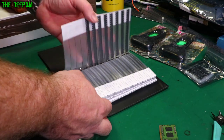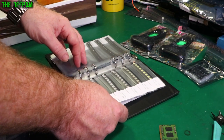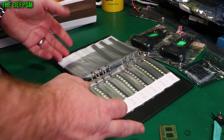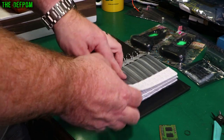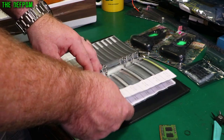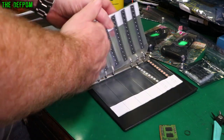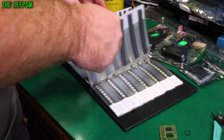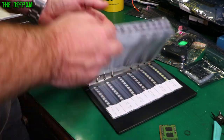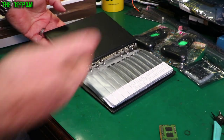It's a sample book - of LEDs! You can blame another YouTuber for this. Mike from Mike's Electric Stuff posted a picture on Twitter about a LED sample book and I thought that's a great idea, so I bought one. It goes 0402, 0603, 0805, 1210, 2835, 5730, 5050s - nice. Different colours, single colours. It's got a pink one - that'd be good. No multi-colour ones unfortunately, no RGB LEDs, which would have been nice. But handy if you need just the odd random replacement.